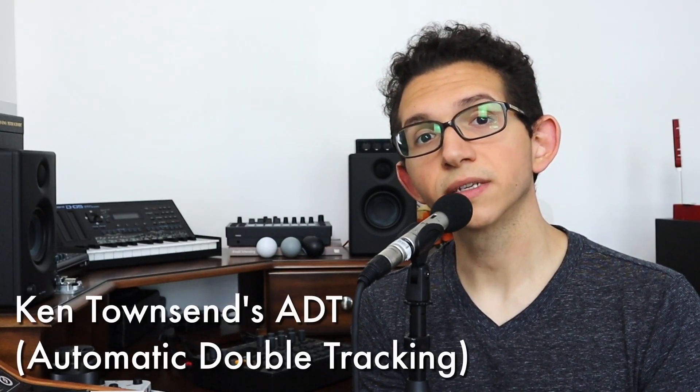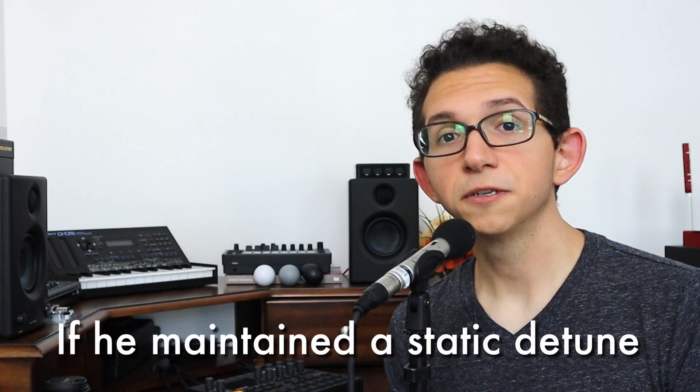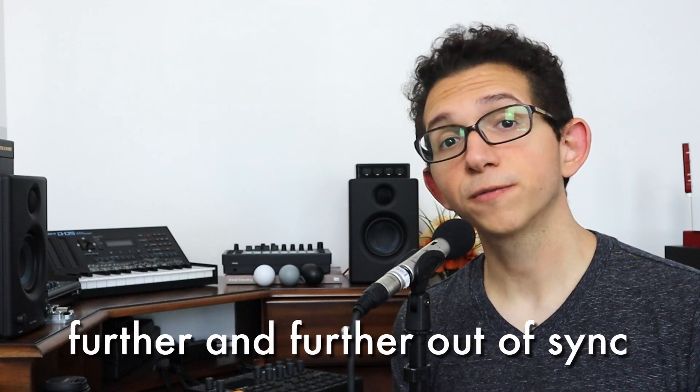In the 1960s, another milestone was passed as we transitioned from electromechanically generated chorus to tape-based analog chorus. In 1966, an engineer at Abbey Road, Ken Townsend, created automatic double tracking — a technique using a second tape machine to combine a signal with a delayed version of itself. By changing the speed of the tape machine, Townsend was able to incorporate detune and add more variation to the duplicate. By oscillating the speed of the duplicate, he could create detune and vary the delay time without experiencing drift.